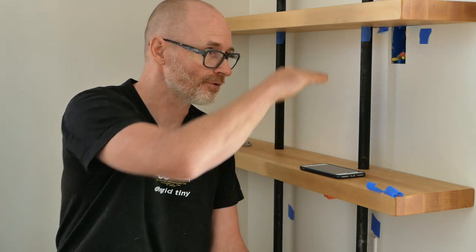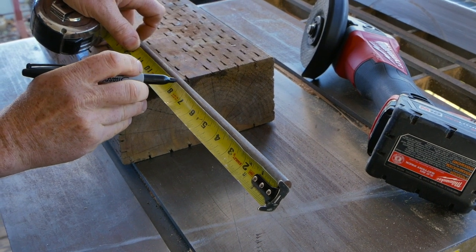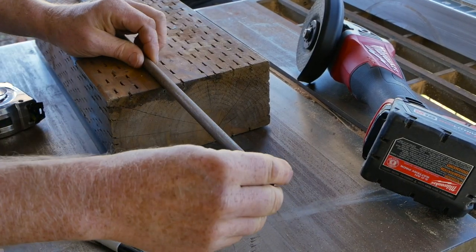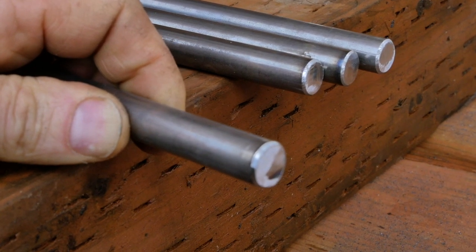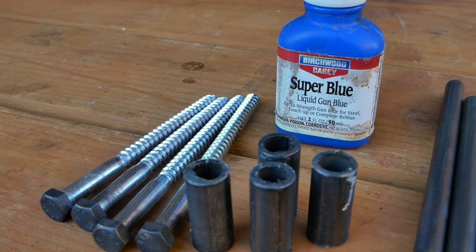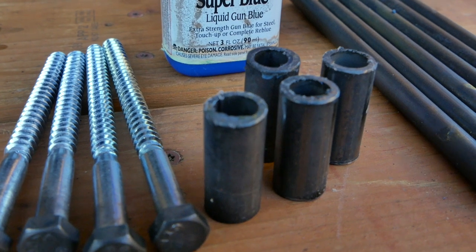Next I'm cutting rod for the support brackets and drilling out the pipes on the drill press. I measure out my steel rod for the shelf pin length — I'll make them flush with the front of the shelves, though recessed a little bit can look nice too. I cut these with the angle grinder and then roll the pipe against the running grinder at an angle to give it a nice chamfered edge. After that I scrub with alcohol and a Brillo pad, then wipe it down with gun blue to turn it nice and dark to match the black pipe. While I've got my gloves on I'll also hit the tips of my lag bolts to darken those. I've also made spacers that sleeve around the lag bolts between the pipe and the wall, made out of 3/8 inch black pipe.